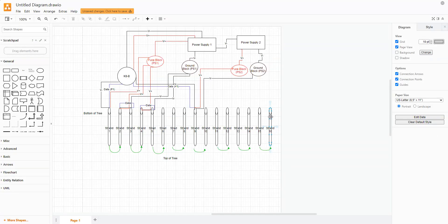Let me help with the power injection question. The picture is a little complex, but to answer the core question: the Kulp controller can support 800 pixels per port. So if your strings are 92 pixels long, that means we can handle eight strands out of one port and would just daisy chain back and forth for those eight strands.